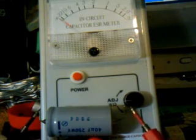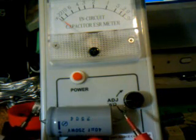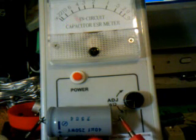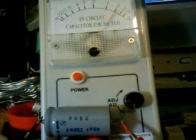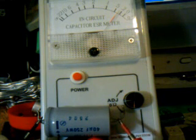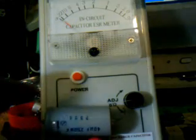Got a lot of new parts but those aren't there. Anyway, look at this one. Here's one of your existing caps on an ESR meter. See how that meter goes all the way up to about 0.2, about 0.3 I'd say — about halfway between 0.25 and 0.5 it flutters around, so it's 0.3. Okay, and that's a 40 UF 250 volt.